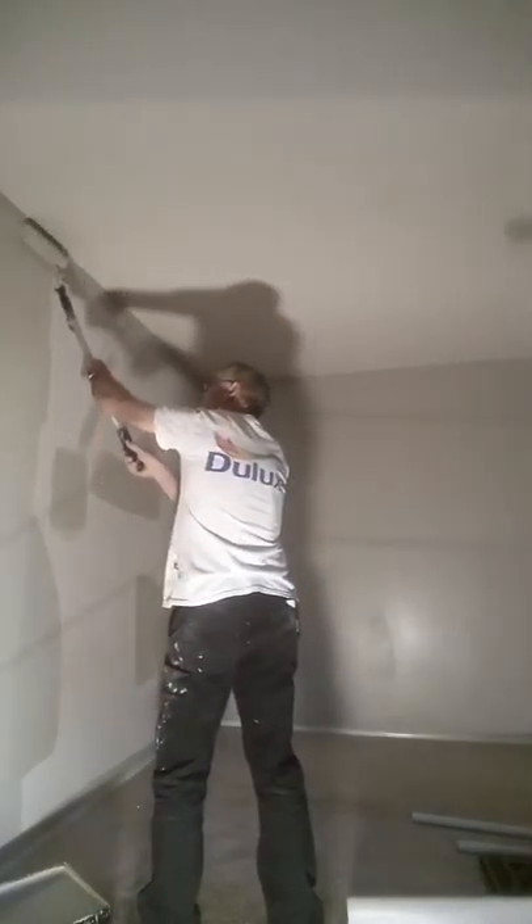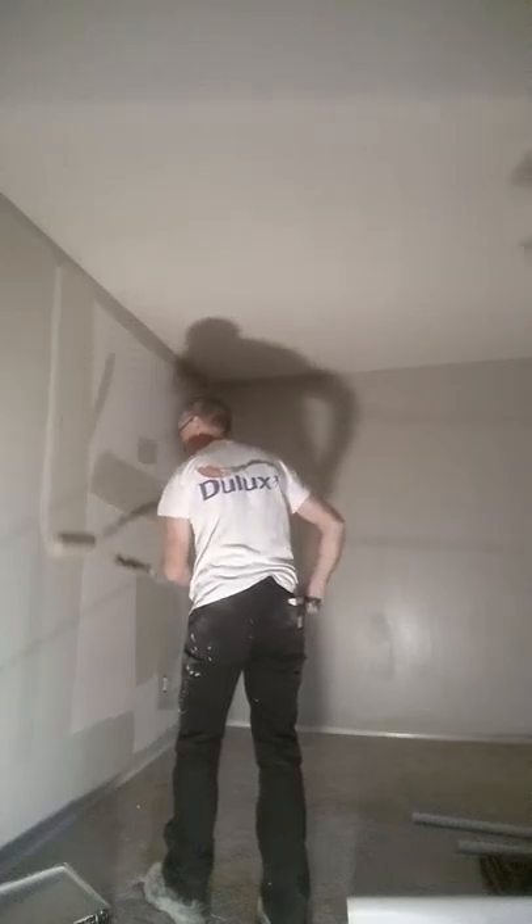Just make sure you overlap a little bit every time. Spread your paint out, roll up close. Down at the bottom, you can just take the roller and roll sideways down close to the baseboard so that you cover the cut.